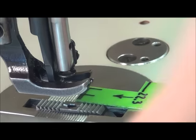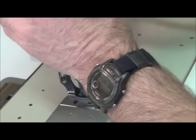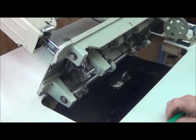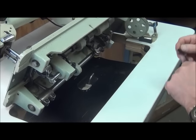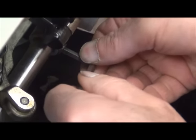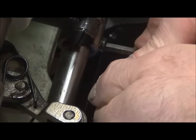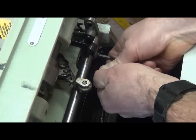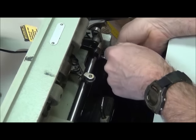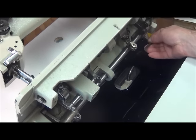But if you had to change it and adjust it, this is how you would make this adjustment. You need to rock your machine head forward and grab your 5mm Allen key. The hex screw down here is what you're going to loosen in order to adjust the feed dog forward and backwards. I'm just going to loosen this up a little bit — that thing is really tight. I'm going to loosen it up and keep this hex key in here.